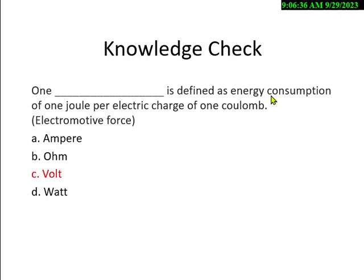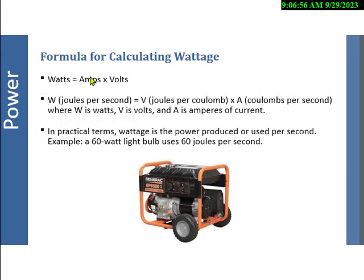If you get stuck, you know ohms is resistance and current is amps. Power is related to voltage — current times voltage equals watts. So if you get a question with a 5,000-watt generator at 120 volts, you can figure out how much current it can put out. The watts of joules per second equals volts times amps. Current, electromotive force, and power are the key words to look for on the exam.